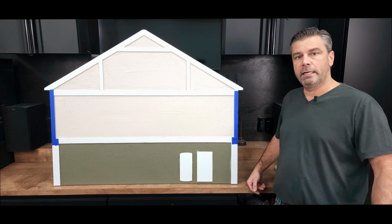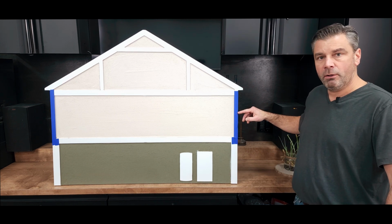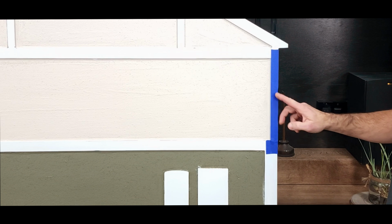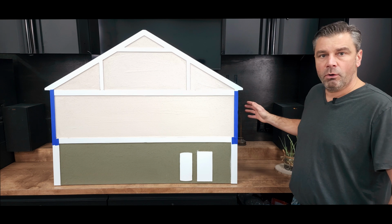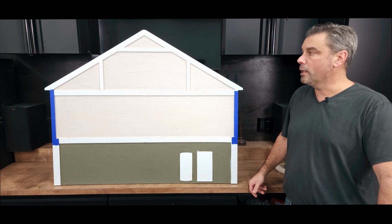If you have a contractor that has the correct equipment, they take a run of siding off halfway up through the wall on the outside, drill about a 3-inch hole in the sheathing. They dense pack it downward with cellulose, dense pack it upward with cellulose, so it's a full solid cavity for the full 8 feet. Put a plug back in the hole, put the siding back on, and you shouldn't really even know he was there when he's done.